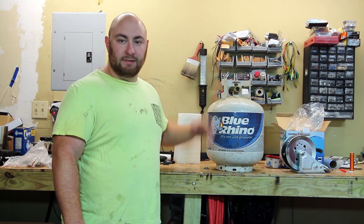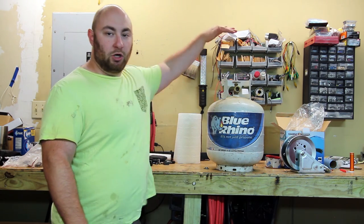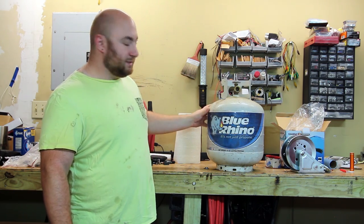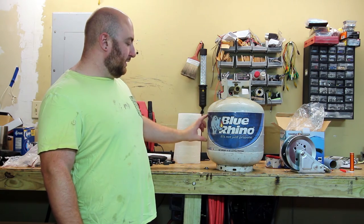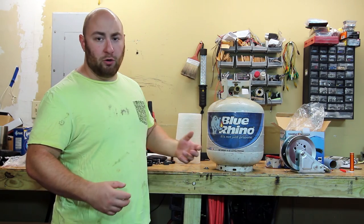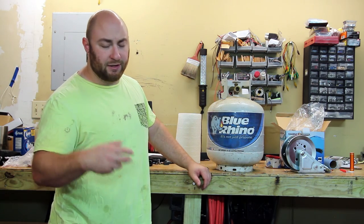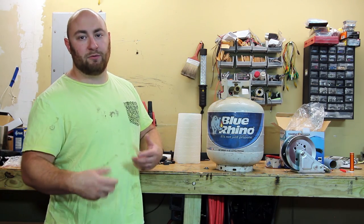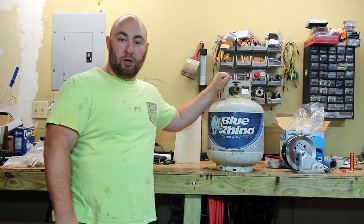So I went on Craigslist and bought two of these guys — this is a standard 15-pound propane tank, same thing that comes with your grill. I actually bought two of these for 20 bucks. I would have preferred to buy one of the larger units but I couldn't find one cheaply, so I bought two smaller ones. We're gonna use this as the base for our forge — cut the top off, use a middle section out of the other one to make it taller, use refractory cement to create insulation inside, and it's gonna be coal-fired. We'll put a tube that blows air in there, and inside there will be a crucible to melt the aluminum.